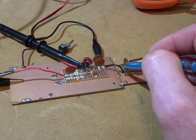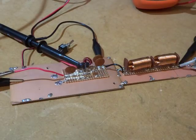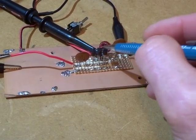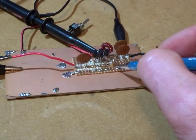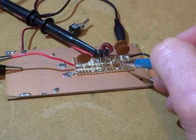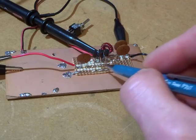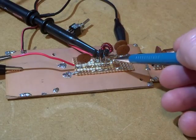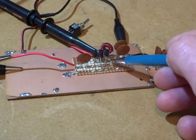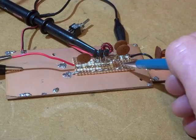My maximum signal — around 5.8 watts at the moment — is with no capacitor across the output. So at the moment this is purely resonating with the output capacitance from those three devices and any stray capacitance on the board, which was quite interesting. In that configuration I'm getting 5.7 watts across that 50 ohm load on the output of the low-pass filter. I tried to minimize any stray capacitance by separating the tracks as much as I could, removing copper material and keeping tracks separated by at least one spare one.